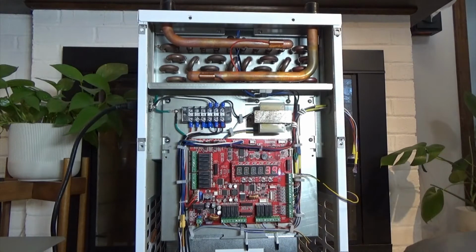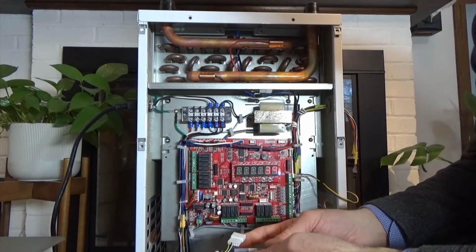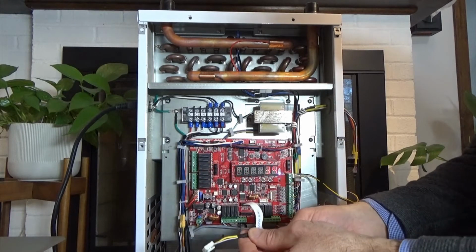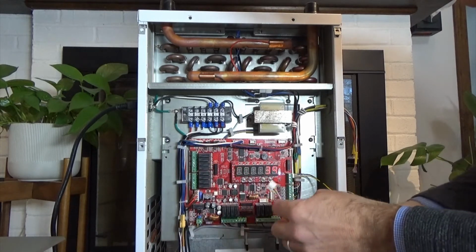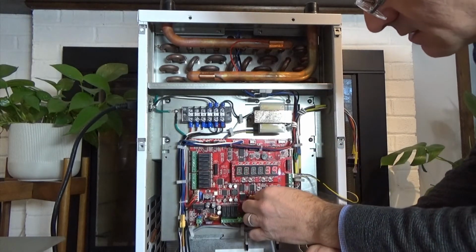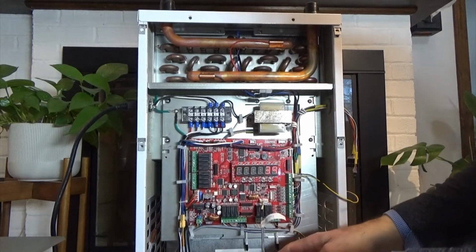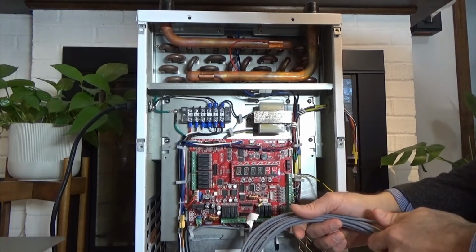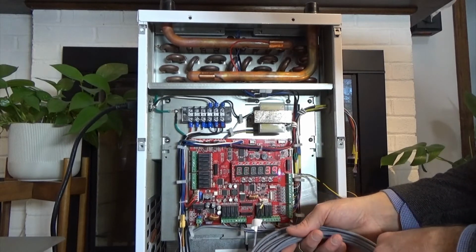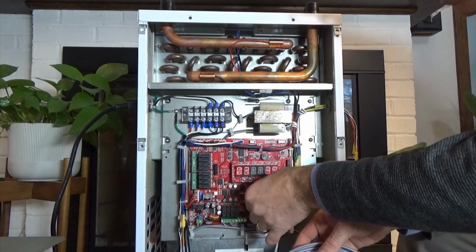Again, I mentioned the Navien communication cable. Again, there are 2 ends. There's the Navien water heater end, and then there is the iFLOW end. And that iFLOW end will connect directly to this lower contact right there. So that connects in, and we have them in 16 feet or 5 meters, or 32 feet, 10 meters. So 2 different lengths that you can select from. And then just wire that over to the Navien.